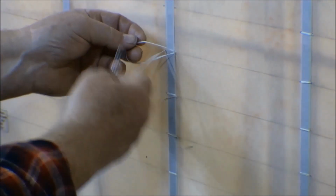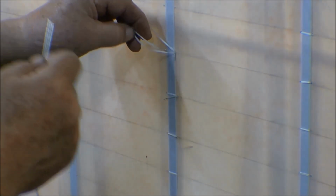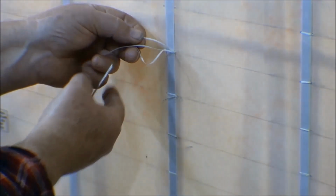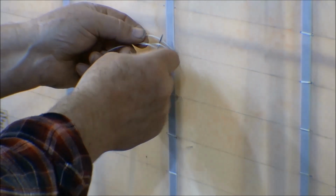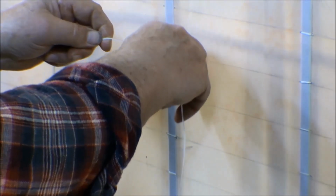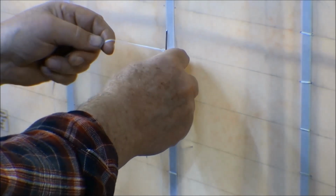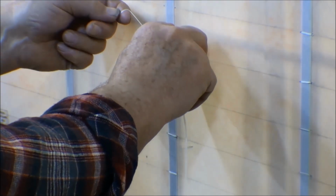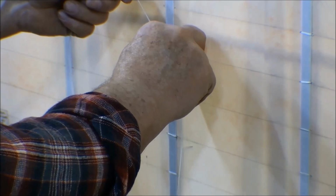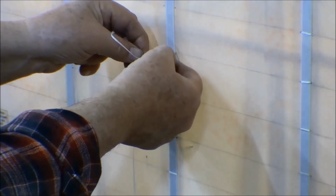There are some good videos on YouTube on doing this. So anyway, you've got a pond, and this is the pine tree or the palm tree or the pineapple or whatever it is. That comes up through there, and you go underneath. This is the slack line here, the slack loop. Go underneath it and over the other loop and pull it down, and then your slack loop will go in there like that. So then you take a half twist on this loop right here and go up underneath the movable end, and then back so that this pineapple, pine tree, palm tree, piling, whatever it is, is up on top of the needle like that. And that gives you a figure eight knot right there.